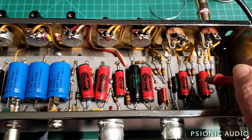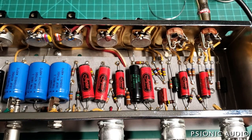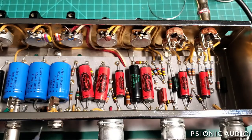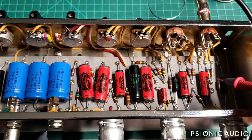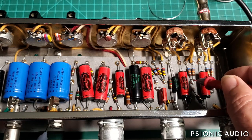These wires pass through underneath. When I first looked at this last night there was a lot more leakage. It was half a volt here — now it's 300 millivolts. It was almost half a volt here — now it's down to 60.